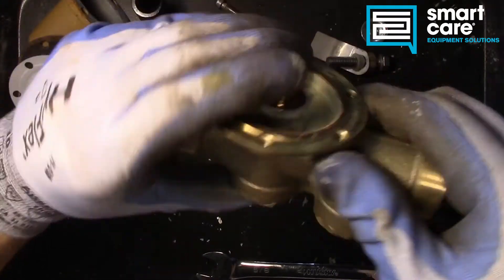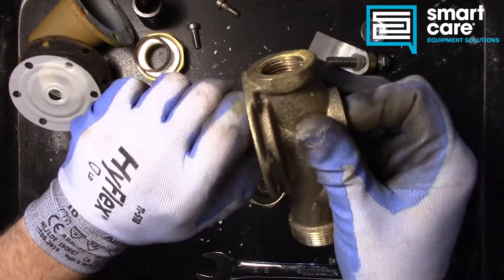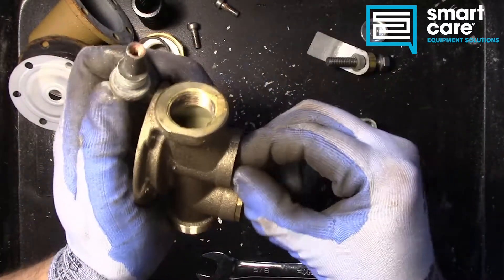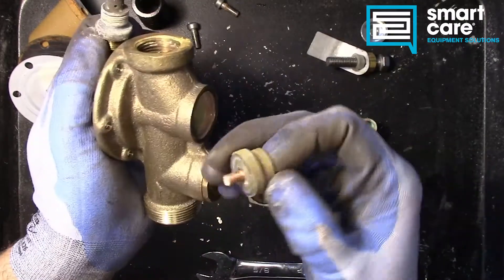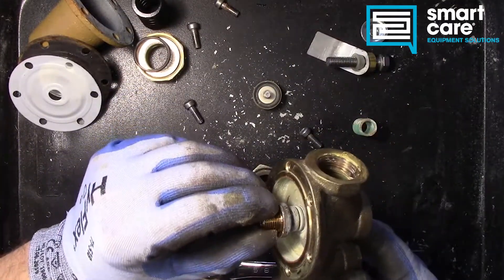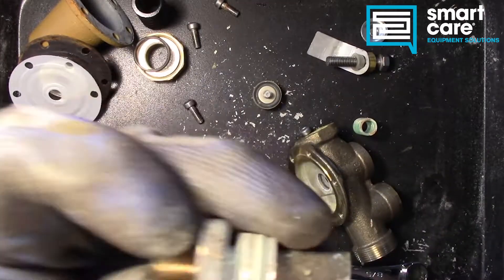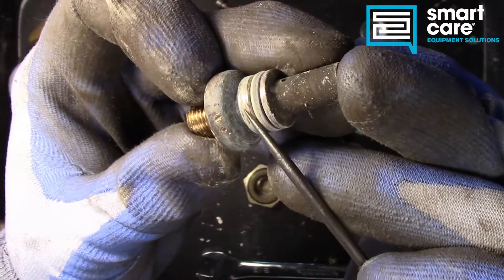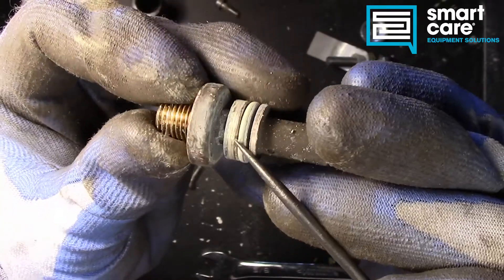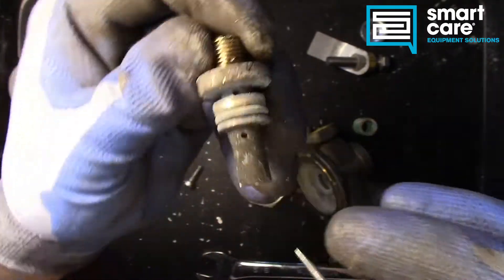So this thing was stuck — it was not pressure reducing at all. We just had so much corrosion that this thing seized up. The lower part and the upper part — looks like our sealing surface and the areas around it got so corroded they just seized, they locked up. That's really impressive. Very aggressive water wherever this thing came from.